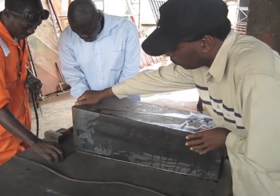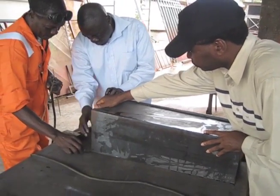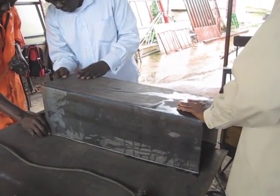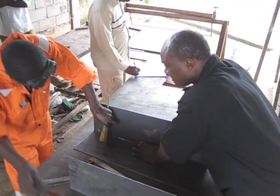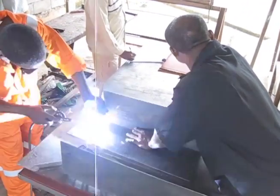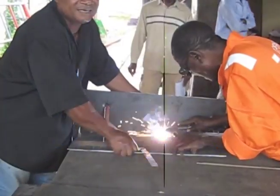Here's a tip. To make the process easier, you can weld two top interior side pieces together, followed by the other two. Next, weld these two L-shaped pieces together. Here's another tip: if you're having trouble keeping the interior mold box in a square shape, you can weld braces across each piece on the inside of the box. It may be useful to build jigs to keep the plate square while you are welding.